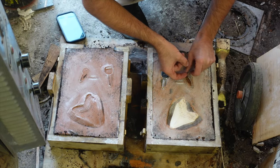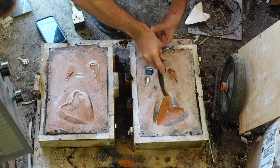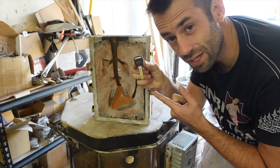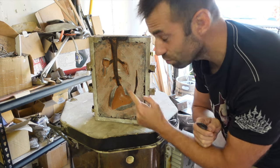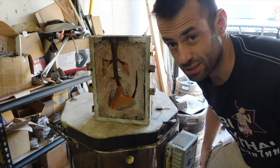The vertical pour is just what it sounds like — instead of the metal flowing horizontally, it flows straight up and down. With a vertical pour, there should be more weight to the metal helping carry it all the way to the tip of the key. I made one impression packing the sand and then two more pressing it in. We'll see how it works, and of course another shark tooth — if it fails, at least I'll have that.